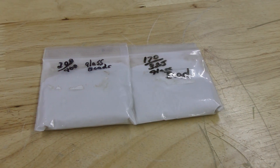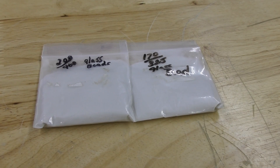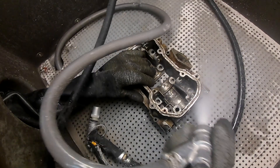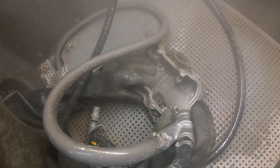First, we are going to start with glass beads. Glass beads are great for general cleaning and polishing of dirty parts — for example, light buildup or dirt. This is because of the characteristics of glass beads: they are hollow, round, and meant for touch-ups.